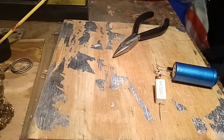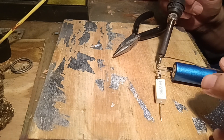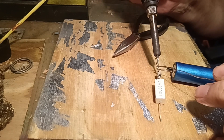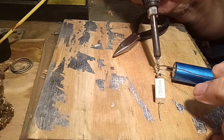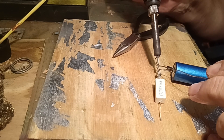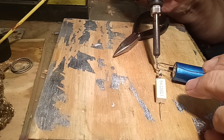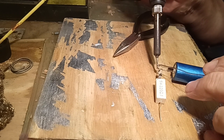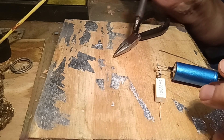So that is all four components actually in the shot. Starting with the resistor — the second diode is covered by some blue tack, or press stick as we call it here in South Africa, that I use just to hold the components down on this little piece of wood that I solder on. I'm using a lead-free solder so that's why it looks like it's a bit difficult to melt — it melts at a higher temperature.